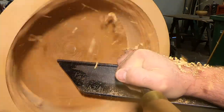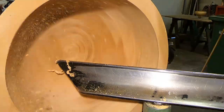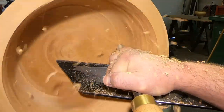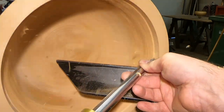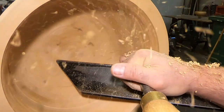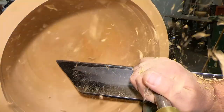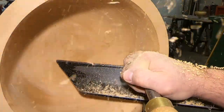I just try not to be too aggressive. I do like to use waste blocks on the bottom of my bowls and homemade faceplates — I'll try and cover those maybe on the next video. I just keep whittling away until you get everything nice and trued up. I do leave my bowls relatively thick. I like a functional bowl that's got a bit of weight to it, and I also need the thickness and the rim to do the inlays that I do. That's kind of why they're the thickness that they are.